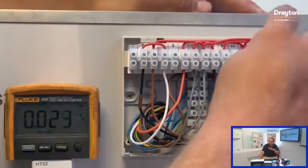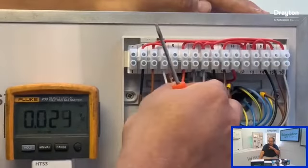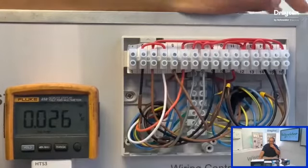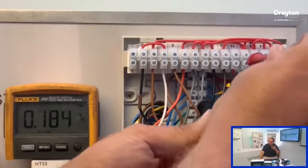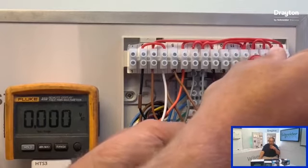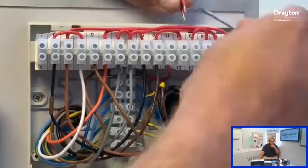This would normally expect the boiler to stop firing, but clearly there it still is. So now this is where we get in and we move it over. So like I just described, wire out. While I'm doing this, I've got the fuse out, so it's dead. As soon as it's back in the wiring center, we can then power up. We can now get in and test terminal number 12 to see what's going on there.